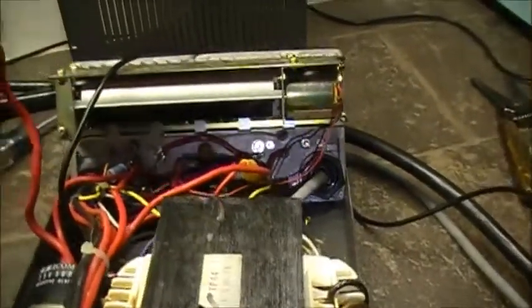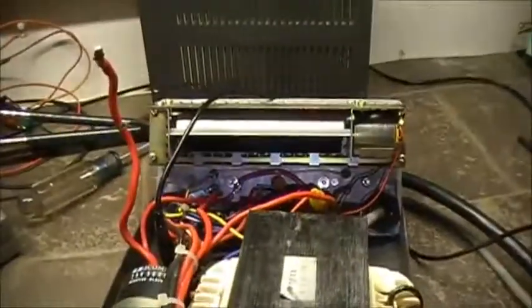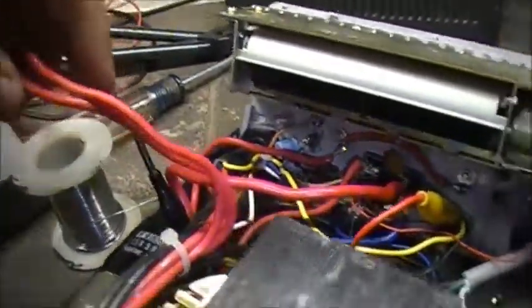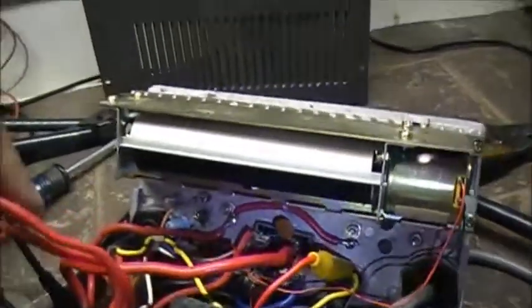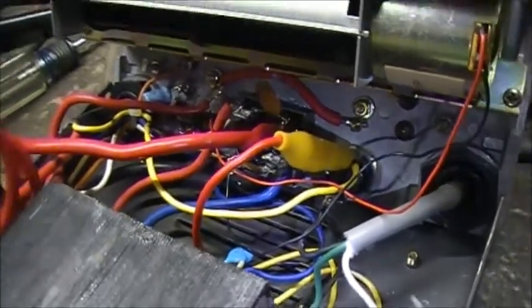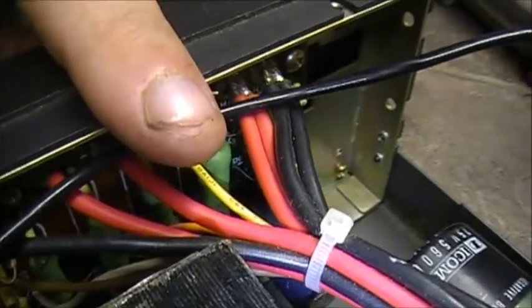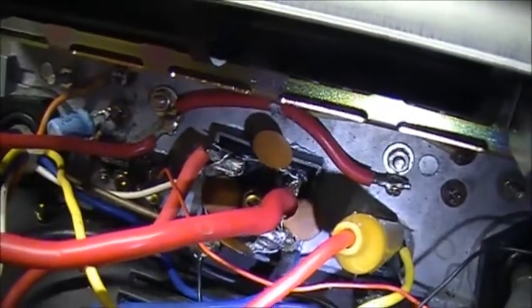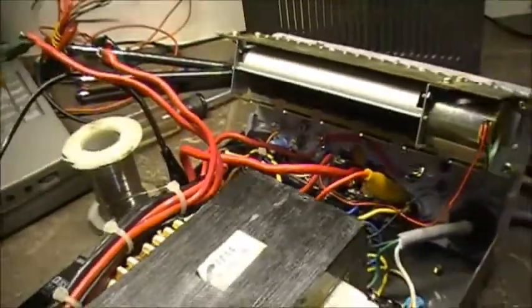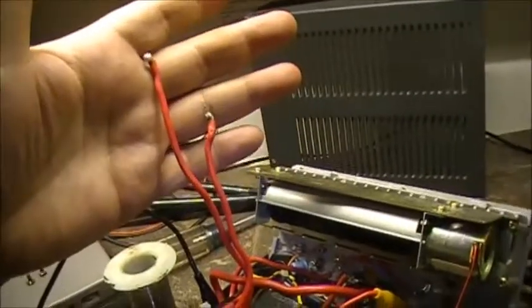So let's turn the power off and test for shorts here. Alright, so next thing we're going to do, I've got the rectifier output reconnected, but I've got the outputs of the two 3055s disconnected, which run back to the input board, which gives you the output. So let's see if we get voltage. If I get voltage back here now, that means we've got a problem with this board. If the voltage disappears, if it's still at 0, then we know we're at the 3055s back here. So let's turn the power back on and see what we get with two of these disconnected.